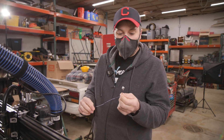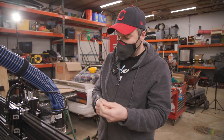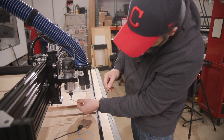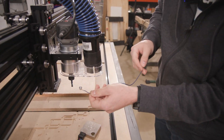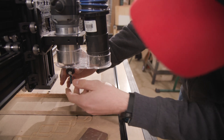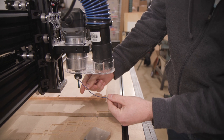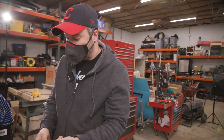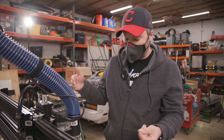What it's provided with is a little magnetic clamp, and this magnetic attachment is supposed to attach to your router bit. The problem is, with this high helix on here, there's no surface area for this magnet to grab onto. You can try to clamp it on, and it actually sticks pretty well, but I've had issues where it doesn't conduct well through the collet down into the bit. Obviously if it doesn't conduct, even when it touches, it's not going to set zero — in fact it's going to crash the machine.